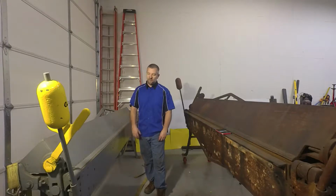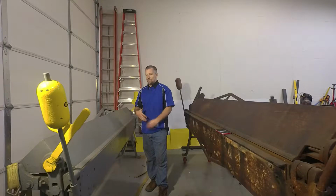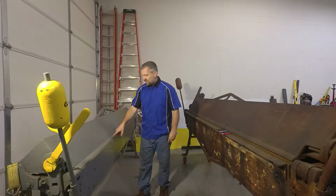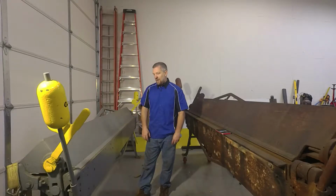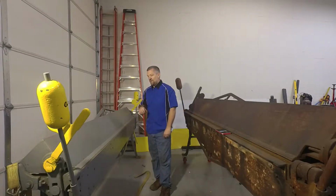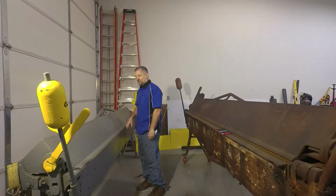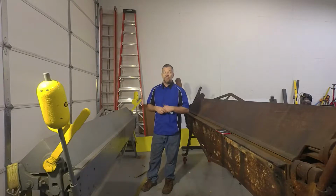They try to bend too thick of metal, or they'll put round pipe or square tube stock in there to try to bend it, and it puts too much concentration on these noses. From what we understand, if you try to bend something that's too stiff, it will cause the blade to push up in the middle. And you'll notice it too with your metal bending if you're trying to do it yourself.